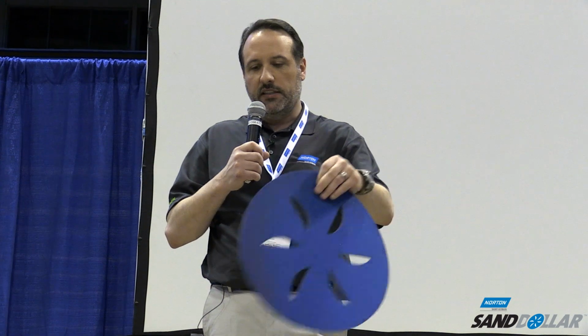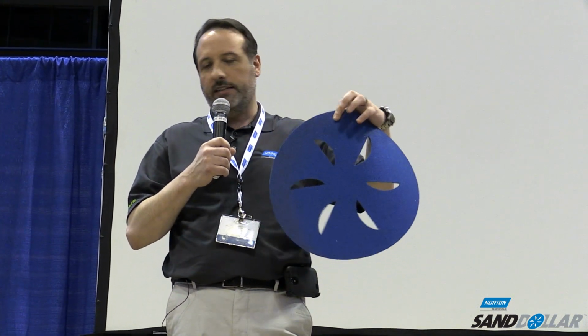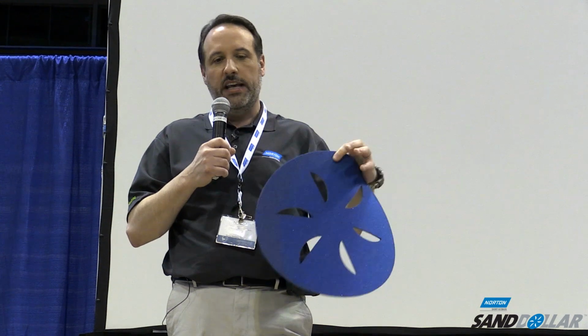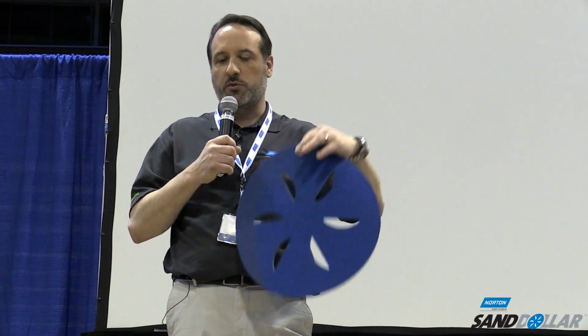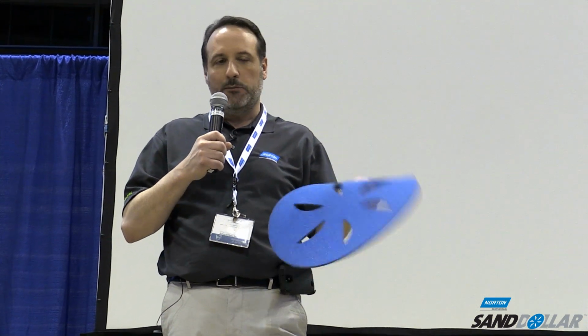And that's where your swirl marks will come from, whether on a screen or using a paper disc. The grain, as it goes across the floor and hits uneven spots, can have different sizes. Longer grains will dig in, and that's where the swirl marks come from, those longer grains digging into the floor. So this really helps eliminate that.